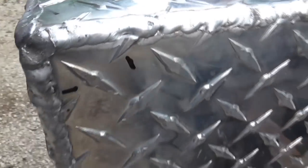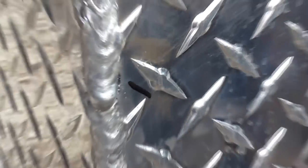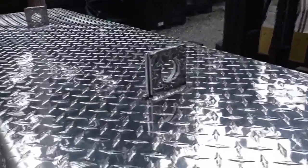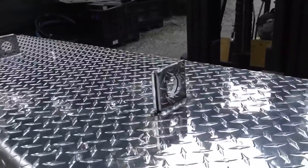Right here it's incomplete fusion. Up here it's a legitimate pinhole, not just peppering in the weld. Incomplete fusion there and a whole bunch more on the bottom. We're going to use a TIG welder to fix everything and then make new lifting lugs — designed on the computer, CNC cut, nice and big for a big strap that'll look nice and appealing with no sharp edges.